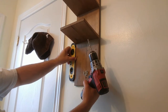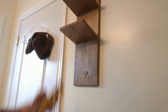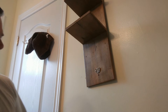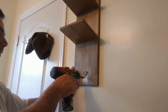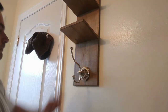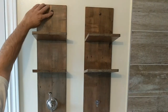My shelf had to be dead-on level because I wanted to install a second one. You can see where I pre-drilled before, installed another anchor into the wall, put the piece on using the screw, and then used the hook to hide my drill hole. Then it was time to cover the remaining drill hole with a plug.